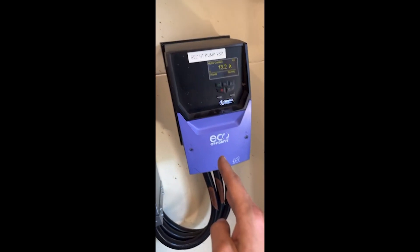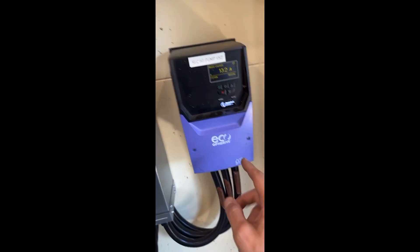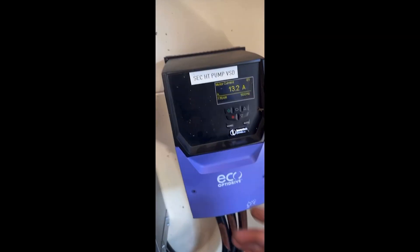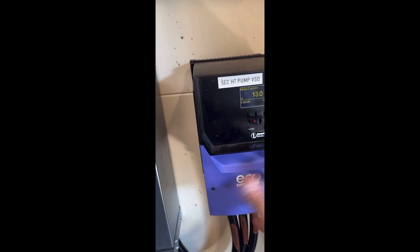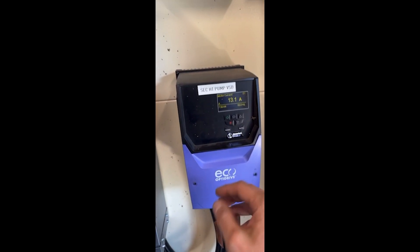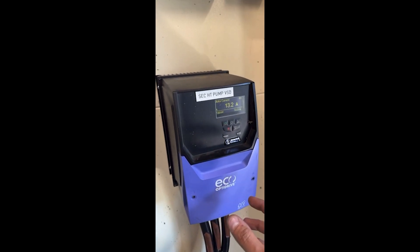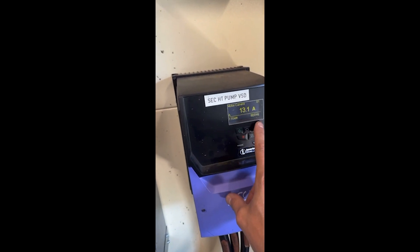The golden rule is: if you want to make a DC motor — say a 12 volt DC motor — go slower, you give it less voltage; faster, you give it the voltage it requires for top speed. On an AC squirrel cage motor, the frequency is what controls the speed. So at 50 hertz that's top speed; drop to 25 hertz, that's half speed. These can adjust speed, provide more torque, give inching control. They used to be really advanced bits of kit when I first started, but they're ten a penny now.